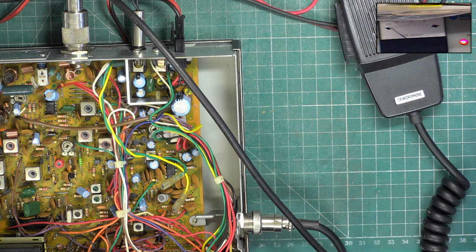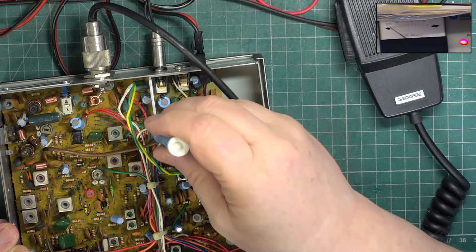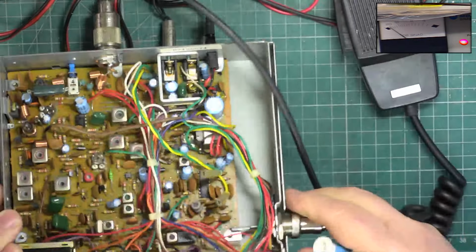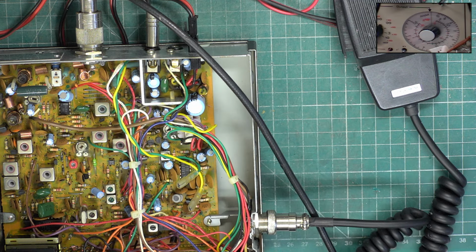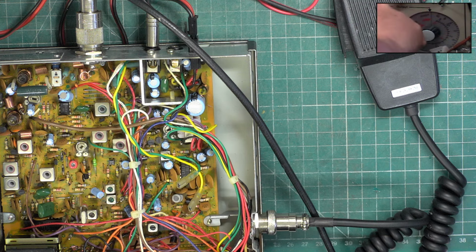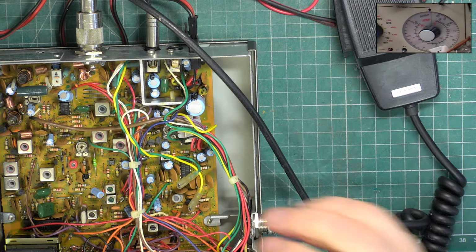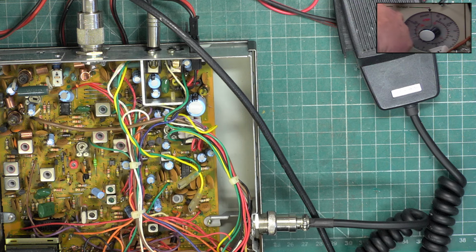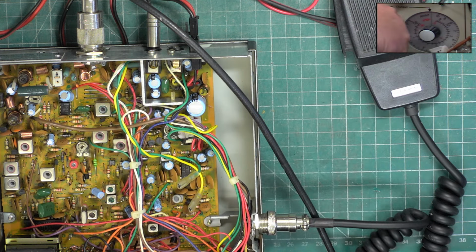Let's set 100 microvolts on the S meter. Well, that's being very generous. And then the squelch. So squelch to full. And on the test set of 100 microvolts, that's 30, want it a bit stronger than that, but not as strong as that. Right, balancing act on this chassis, you know. Squelch is the only letdown. That's it, we've got 100 microvolts.